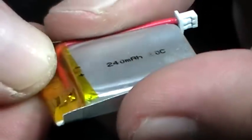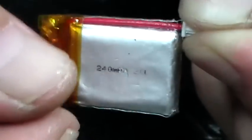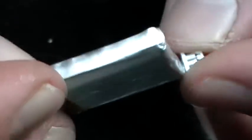So now we've got a good coating of Kapton tape over the top of that. And once you've done that, just basically wrap the whole thing with Kapton tape until it looks like this. So just basically folded the sides down on the edge and then ran the Kapton tape around about 3-4 times, and that's it. So now it's ready for the Velcro, and yeah, it's basically a strong connection. And there you have your finished batteries sitting in the charger quite happily.